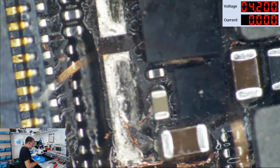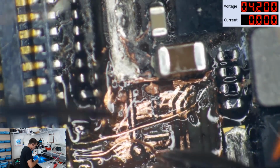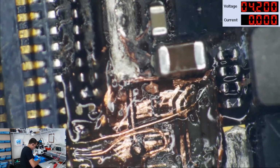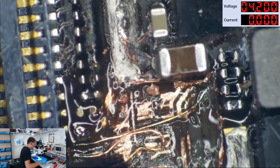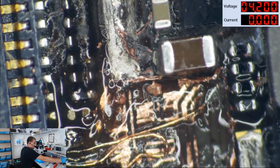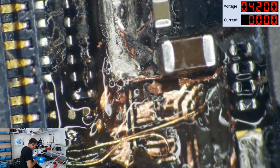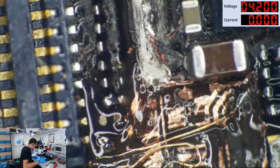Okay. Now, in an effort to try not to let this thing get so hot that it detaches, I'm not going to make this wire straight. I'm going to sort of hoop it around, and then come back to our chestnut enable nub here. I'm doing that to give me a little bit more of a heat sink in my wire, because when I solder this down, I don't want it to accidentally unsolder from the tiny little trace that I just soldered to. So a little bit more wire there. Okay, and then we're going to try to solder this right down to this via. And a little more flux on that.